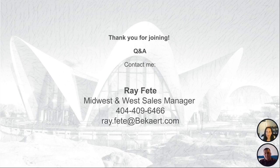A few questions have come in. I'll start with the first ones that we received. Laura asks, can Dramix 5D galvanized fibers be a possible option for industrial floors to prevent corrosion, or are they more suitable for different applications? Yes, they can. That's one of the reasons we have the galvanized fibers, especially since they're used outside a lot. But yeah, they're there for corrosion resistance.